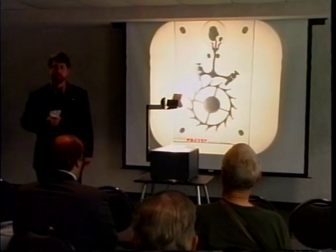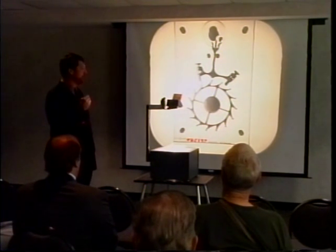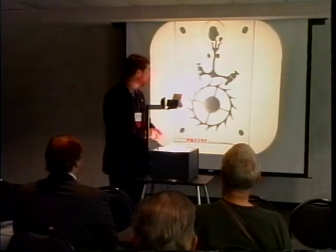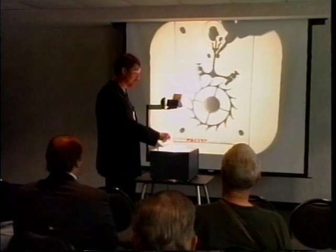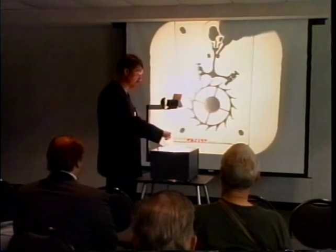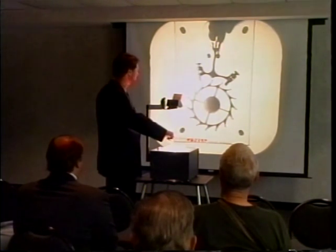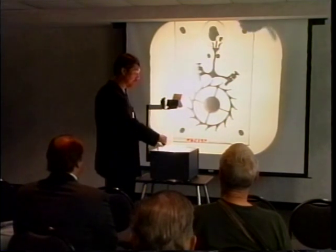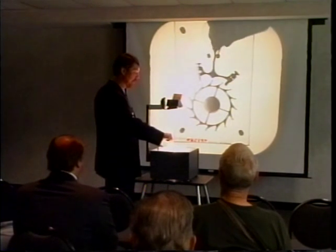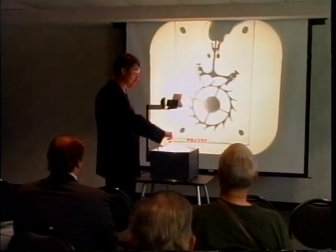It won't let off. All right, so now we have to go back to the banking pins and recheck our clearances. Remember what we do to one side. If we open this enough, is that a banking problem? It's a clearance problem, because we didn't have our banking pin open wide enough to accommodate what the jewel's going to have to be. We'll fix it here. I'll show you.